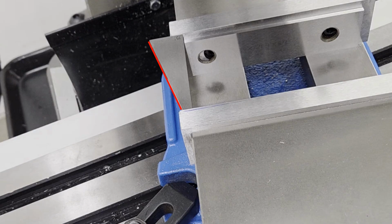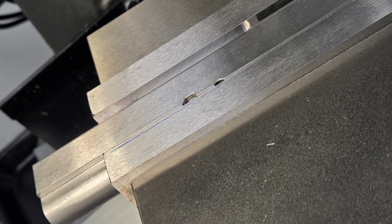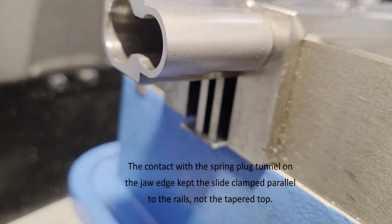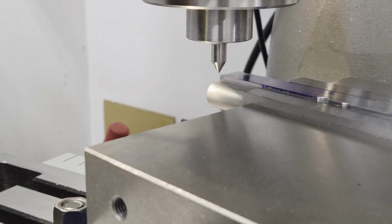Sweeping across the block clamped in the vise and making it 0 on both ends is quicker and easier. I had to clamp the slide at the right height so I could machine 30 thou deep, but the vise would be contacting both sides of the frame rails. I had to shim up a set of parallels with a straight edge to get this. My datum was the front bottom corner of the slide.